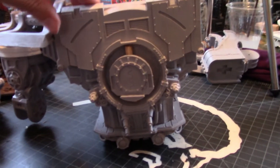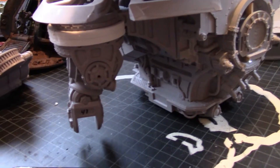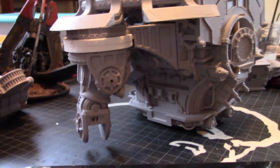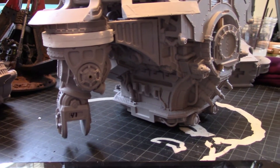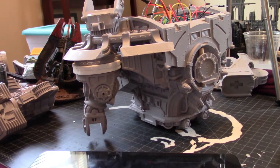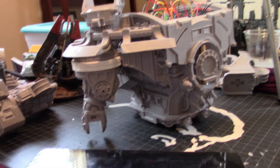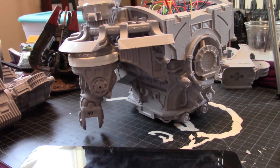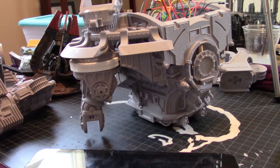For now though, the arm collar is stable and it seems to be holding the weight very well. I've hit it with some solvent-based glue that kind of melts the plastic just a little bit to blur it all together. But that's kind of where we're at. Got a couple of engineering challenges to work on — the torso servo is being annoying as is the head servo — but it's all coming together.